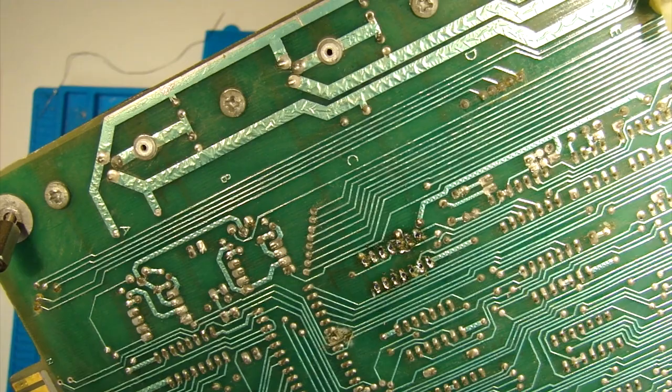Okay, so I've just removed C5 — did a bit of a better job this time compared to the first one I did. I went to use my solder station's solder pump there, but it came on for about five minutes while heating up and then just cut out. So that's another repair to do. I shall clean this up, put a socket in there, and wait for the chip to come. I'm pleased to say that after replacing C5 I'm now back to where I was before — with a thin horizontal line. That's the problem with these old computers: in repairing one thing, something later on could fail. Hopefully that will be the last thing going forward.